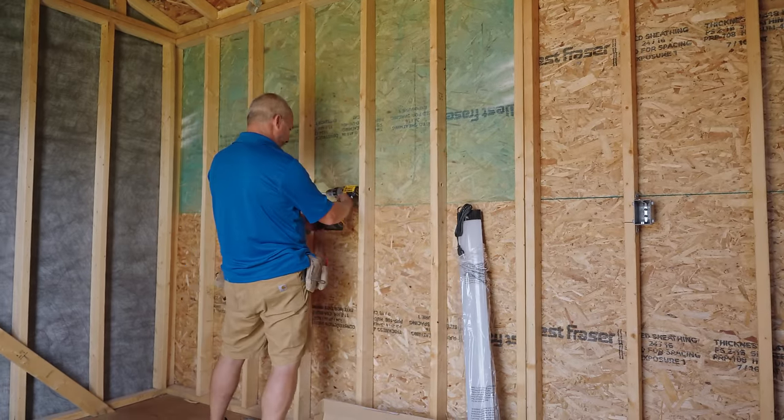It's just tricky. Now here, we push down, bend forward, and when I push and straighten up, it comes out of the box. That's how you get it in there without a problem, okay? And then my sheathing, I'm bringing it right down to here. Now we're on a circuit, okay? We're going to be running two hots and two neutrals. So before I can go any further, I'm going to run the rest of my wire through my holes, over to here, over to this box.